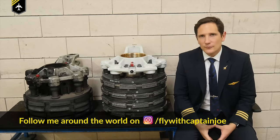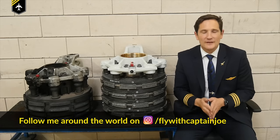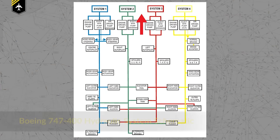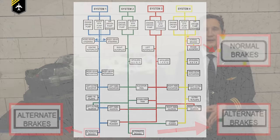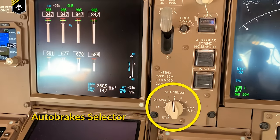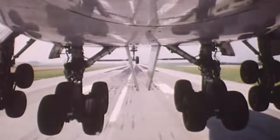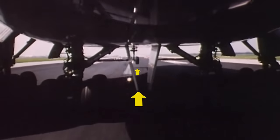In general, pilots operate the wheel-mounted brakes of their aircraft by pushing the toe section of the rudder pedals forward. The braking and therefore the deceleration itself are achieved by one of the hydraulic systems providing the wheel-based hydraulically actuated brakes with pressure. Braking is a process which can be taken care of by software, allowing pilots to focus on other things while performing a landing. Today's airliners are equipped with a so-called auto brake system capable of managing all necessary braking in the longitudinal direction, helping not only while landing but also whilst taking off.